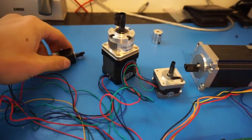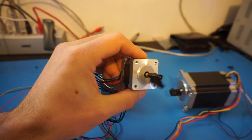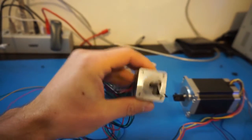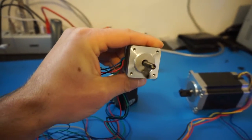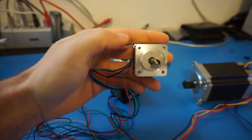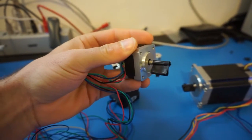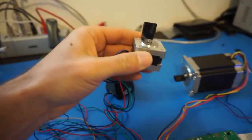You can see them all moving differently. Now the first thing we see is the stepper just moving back and forth, and you'll notice it's accelerating and decelerating. The cool thing is the Raspberry Pi is not doing anything — the Raspberry Pi just tells it to go to a certain speed and it handles all of the acceleration and deceleration automatically. So the Raspberry Pi doesn't have to toggle step pins or do anything like that, and that makes it very, very powerful. It can do it to more than one motor at once.